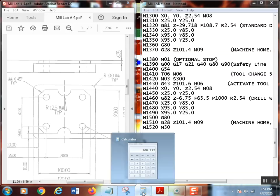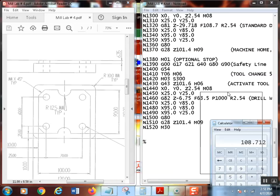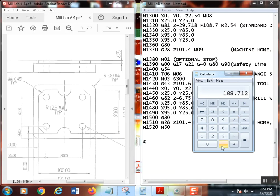So let's talk about how we come up with countersink depths. I'll put up a little video on how to calculate 90 degree countersink depths. Remember, there are different standard included angles for countersinks. The most popular being 90, 82, then there's 100, and then there's 110. I believe that's an aircraft countersink. I'm not really sure. Those would be most of what's out there. Rarely will you find a 60 degree, but I'm not going to say it's not out there. Maybe you want a 30 degree chamfer per side.